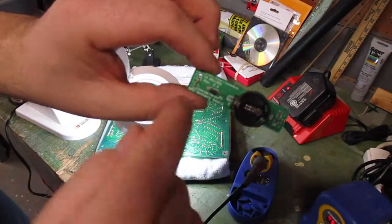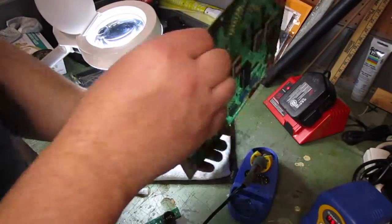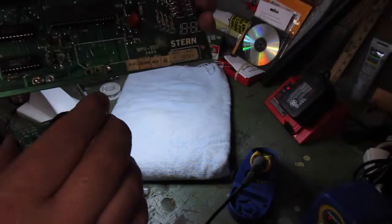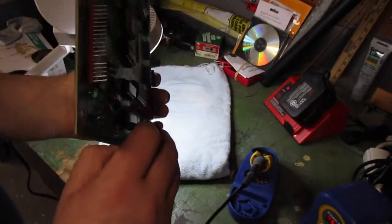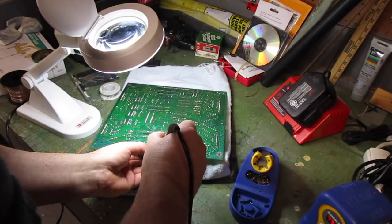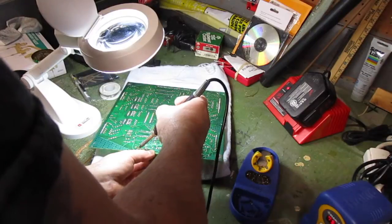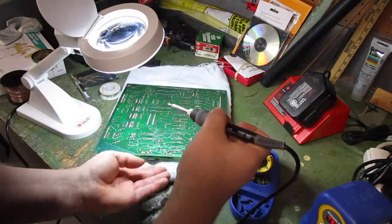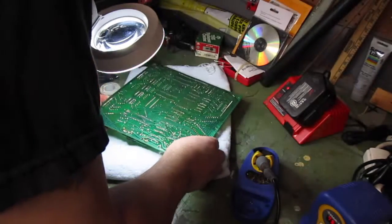Now, and this is really nice, it's got the plus and negative on my board. It's got the plus and the negative. This is going to be the fun part since there's some solder in there already. What I'm going to try to do is heat it up from the back and just get it to flow in there. Like that. Let me get on the tip there. And it looks like it went in. This one just needs some solder on it.